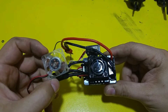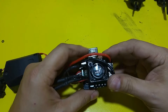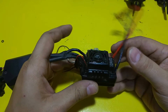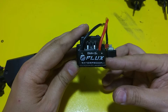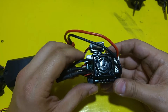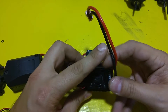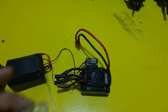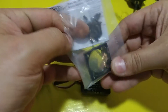This fan is a 25mm. The ESC is basically a Hobbywing WP-80. This will probably work for most Hobbywing ESCs that have a 25mm fan, but of course your mileage may vary. This ESC itself is the EMH-3S — this is an HPI ESC, but all the Hobbywing programmers and codes work on it, and it has the same specs as the Hobbywing WP-80, so I'm assuming it's the same one. What we're going to do is take this and put it on here, and I'm going to use this 25mm to 30mm adapter to do that.